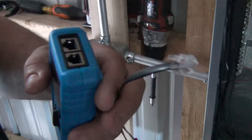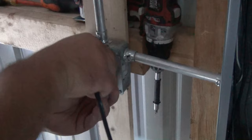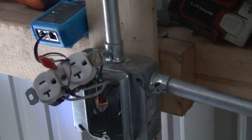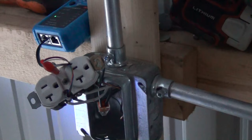On this specific tool you have alligator clips, and it plugs into an RJ11 telephone cable. You take the alligator clips and attach them to the outlet. We've got our alligator clips hooked up. Turn the probe on — it's called the probe — turn the light on, and then we'll scan. Make sure the volume is up and test it, because most likely you're not going to be this close to the box.